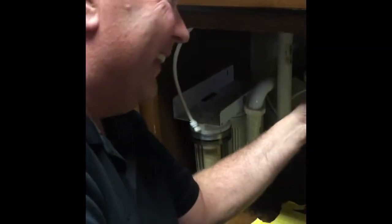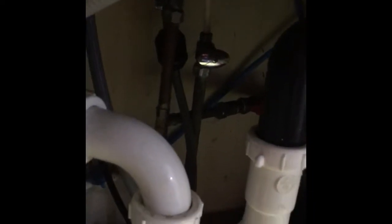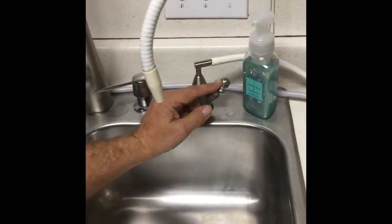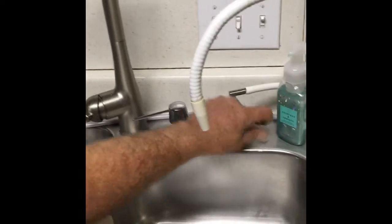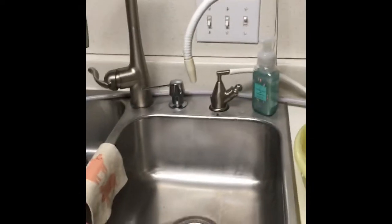The thing we do is you have to shut off your valve to your water line. Shut off the valve to the water line, that silver thing. I know this one right here. See this little white hose that goes to the machine? You find that valve, and then you shut that off. You need a flashlight? So you shut off the water valve. Then come up and relieve any pressure you may have in the valve.